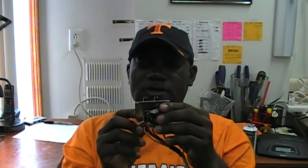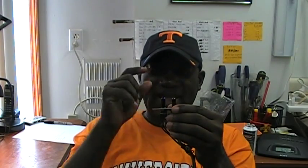This is a vintage set of switches — a vintage start switch. The start switch is necessary to start up the tone generator in the Hammond organ: the Hammond A100s, the Hammond B3s, the Hammond C3s, the Hammond M series of organs. The start switch is a 6-amp, 125-volt AC to 250-volt AC, spring-loaded, single-pole, single-throw, bat-handle switch.